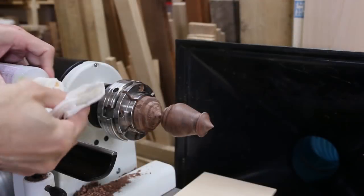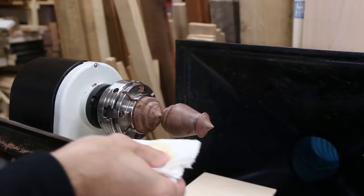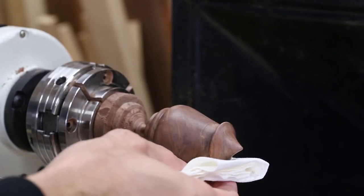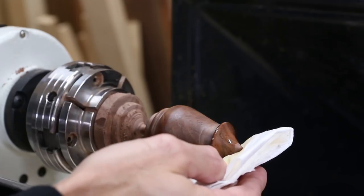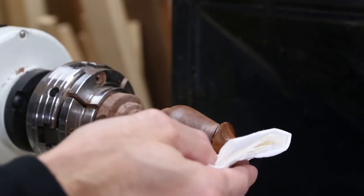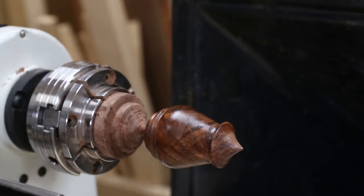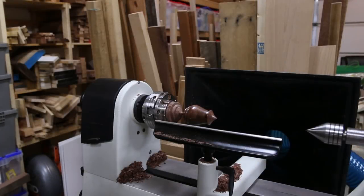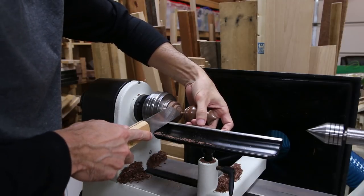With everything sanded I went through my finishing stages using the wood turner's finish — and I had some questions about it, but that's the actual name: wood turner's finish. It's not some secret formula that only wood turners know. I have a link in the description to it and everything else I used. I applied five coats, sanding in between each one like previous days. Then since this was the last turning project, it was time to man up and try to part this piece off the lathe instead of sawing it off with my flush cut saw.